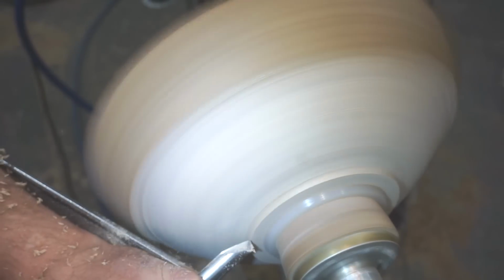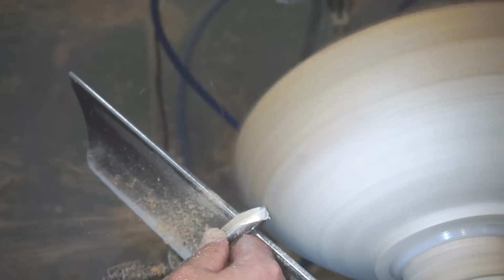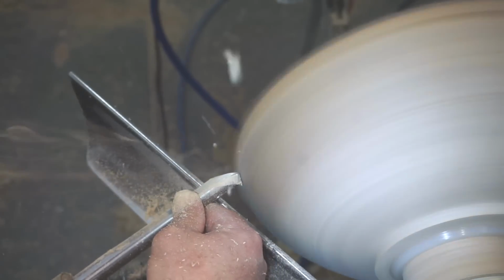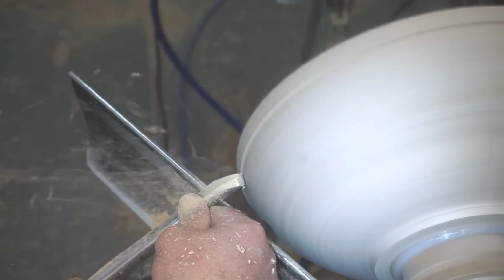So it's too bad that this bowl had warped so badly, because it would have looked really nice with an inlay. But of course, this is a great opportunity. I've been wanting to try this Poly X oil. I don't know why I called it Poly Oil. There's an X on the end of it. And I figured that this was a good candidate for it. Soft maple, which this is, is a fairly decent wood to gauge this on. Of course, the harder the wood, the better the finish typically will happen. So the softer the wood, like butternut or poplar, you're probably not going to get as good a shine. And this is right in the middle, so if we get a good shine on this, then hopefully this should suit our needs.